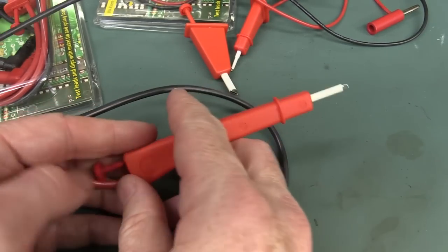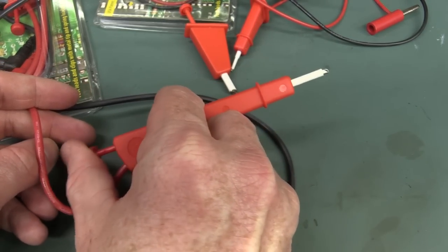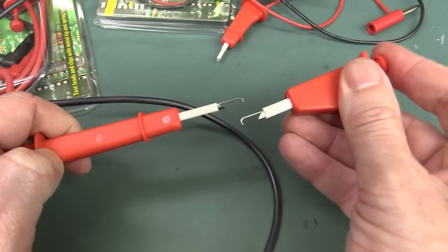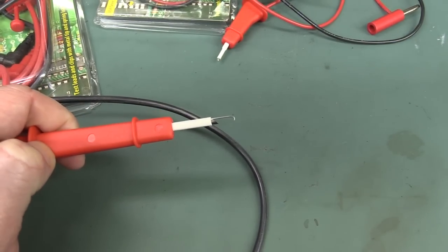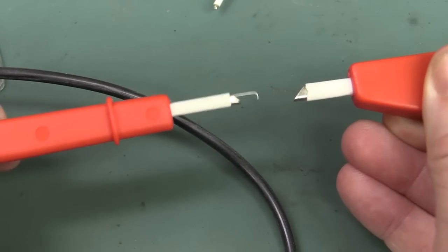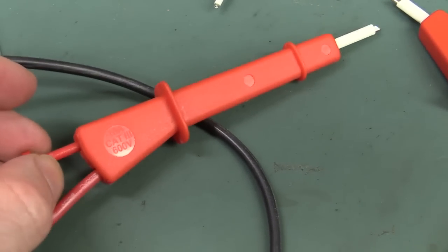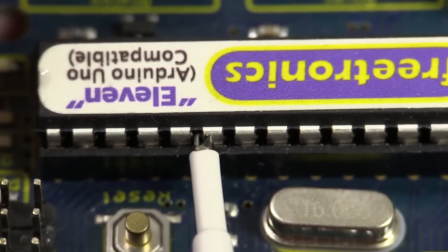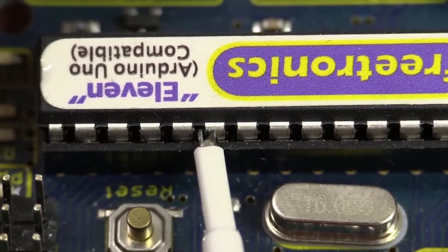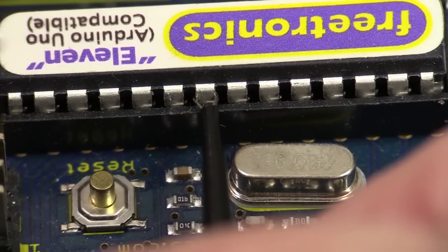I really like these. The Paraclips are a good solution - just get your fingers in there and bam, it's got a decent hook on the end. The smaller one there is not quite as hooked. They do grip fairly well. Quite innovative - I'd rather use these than alligator clips any day of the week. But I really wouldn't want to use these to probe IC pins. It just doesn't work. Completely wrong tool for the job. It can easily short out to the one next to it, whereas with your easy hook, no problems whatsoever.